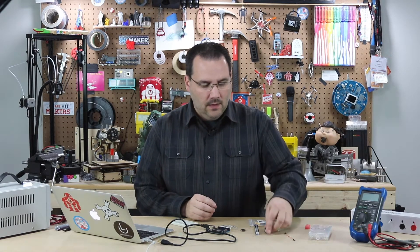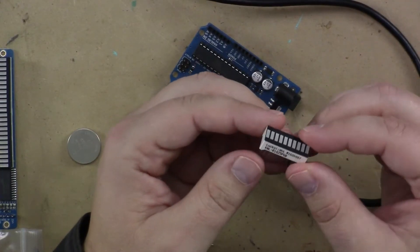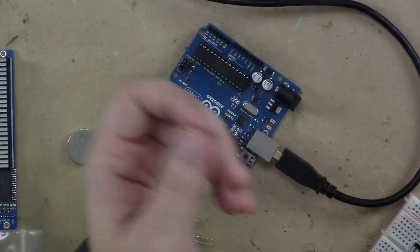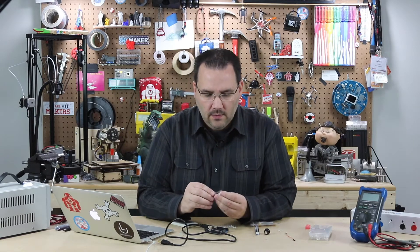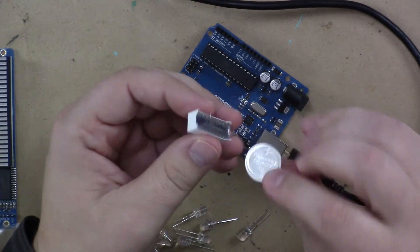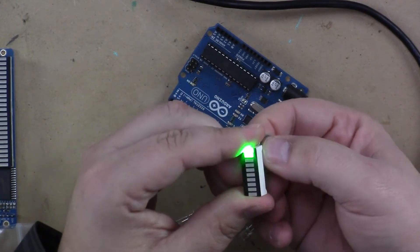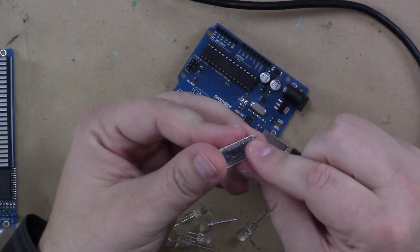It's going to take a little while because I've got a lot of them. You could also use something like this — a really nice package that has a bunch of built-in LEDs into one component. It is breadboard friendly. I can actually demo this really quick. If I bend a few of these leads over and take a coin cell battery, this 2032, and put it in here, you can see I can make that connection. That's just a bunch of rectangular shaped LEDs in this plastic enclosure.